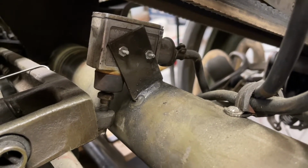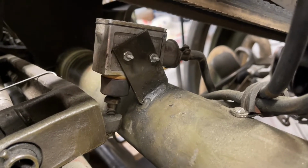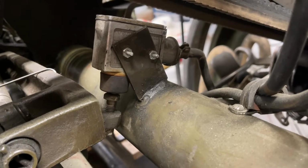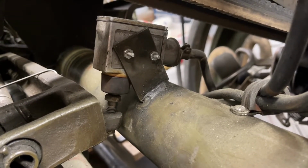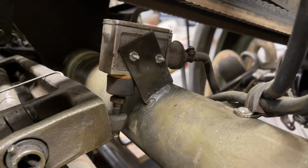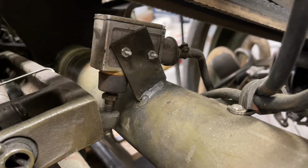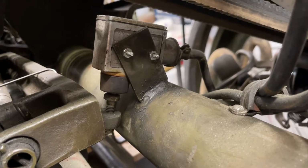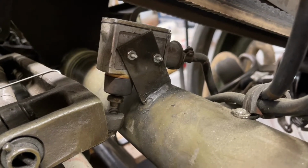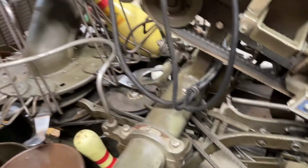If you ever have a machine that's flickering during the cycle, adjust that bolt up a little bit more against that switch. If you really want to test it, lower it down a little bit, and if your machine doesn't turn on at all or the problem gets worse, that's definitely your problem. Sometimes that bolt is just barely pushing on that switch and your machine will flicker, like at 180 or something, at different times. So just play around with that if you think you have a misadjustment and your machine's flickering.